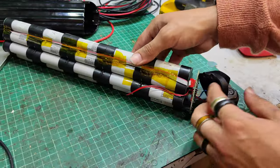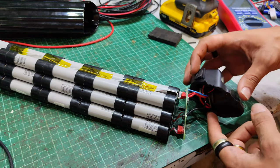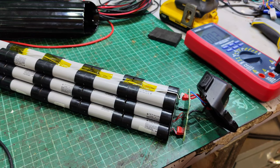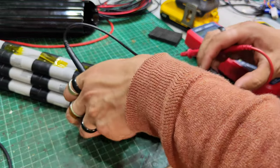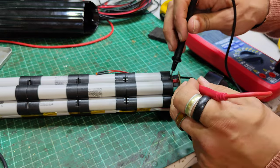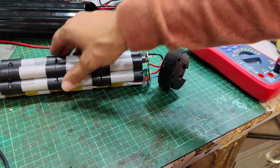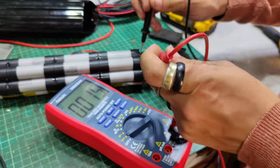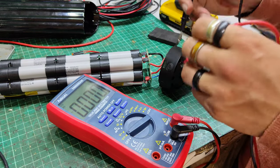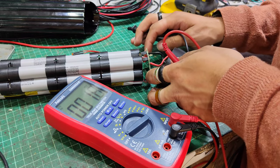Let's see what kind of voltages we get, if it really is a BMS that's needed, or if it's a little bit confused. Coming off the pack, we've got a negative here and a positive here — 22 volts of the pack. That's not enough volts. Going to 2.7. Is that why it's turned off? Below the minimum voltage threshold, I wonder.